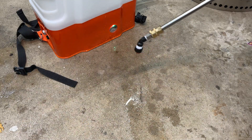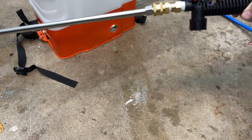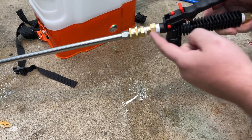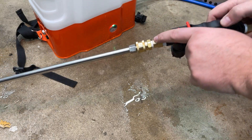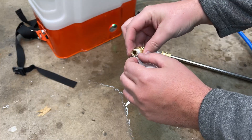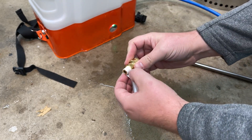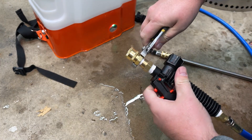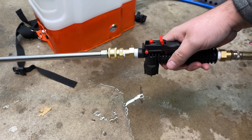Testing it out with a bit of water, and it works. There was a leak in one of the fittings — the brass adapter from Petra is a bit short and does not allow the full length of the quarter inch MPT coupler to thread through and into the adapter. So I added a bit more thread seal tape, tightened it a bit more, and I was all set. No more leaks.